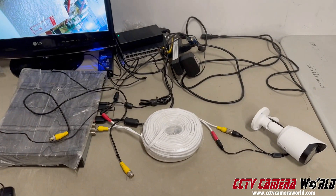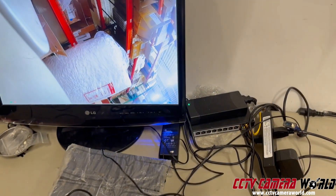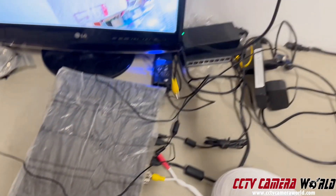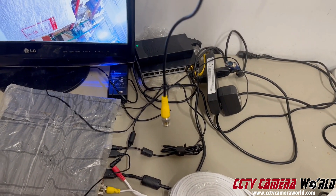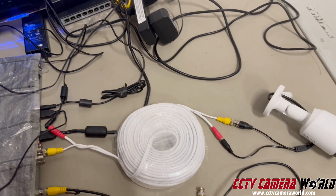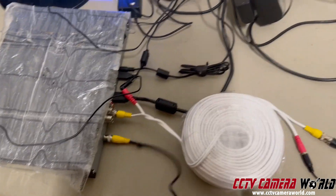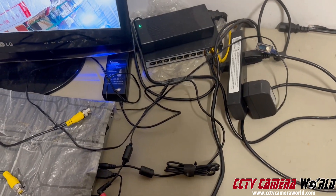When you're bench testing a camera and you've got your cable run already but you're not getting a nice clear picture with our analog security cameras, what you need to do is get yourself a short known good wire. We sell these 3 foot length cords — it's a pre-made cable but it works fine at short runs even with 4K cameras that we carry. Then a 12V 1A power supply — use that as your toolkit for testing cameras. I always recommend getting this 3 foot BNC patch cable and a 12V 1A power supply to test the cameras.